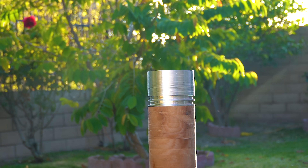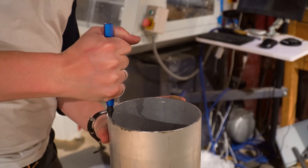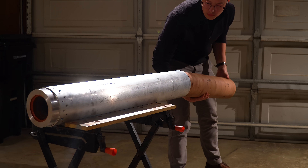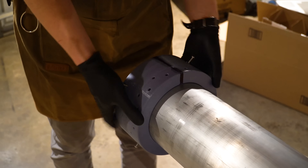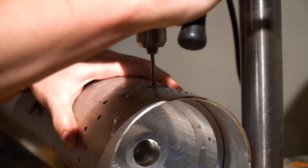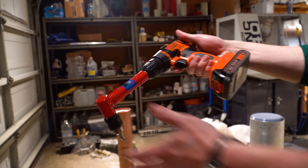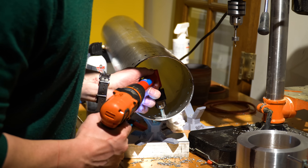With the grain now faced, we can line up all the parts and cut the case to its final length. I did this using a horizontal bandsaw, which is great for cutting big tubes like this. I used a tool to deburr the inside edges of the tube, which helps protect the O-rings as they slide in. Now we can set the forward closure position: I loaded the nozzle and propellant grain, then slid in the closure, and after double-checking distances, I removed the nozzle and liner and drilled the same bolt pattern using a 3D printed drill guide. First we do the holes in the case, then slightly smaller diameter holes in the forward closure, which get drilled and tapped as M5. I also used a 90-degree drill chuck and chamfering bit to knock down the inside edges of each radial bolt hole, which helps the O-ring slide past the radial bolts without tearing.